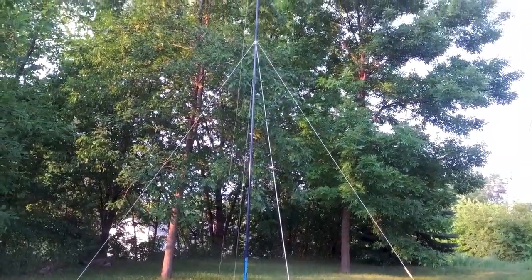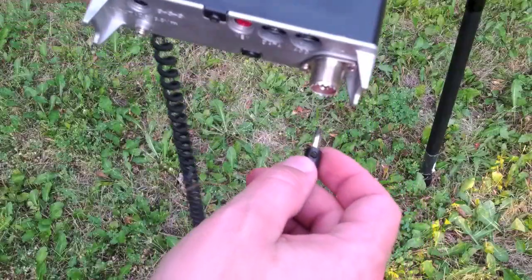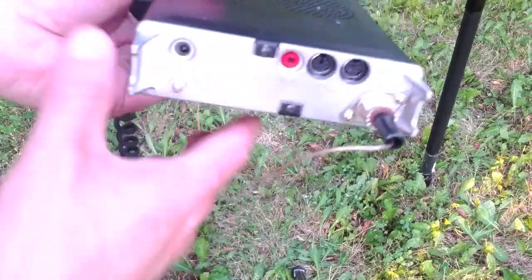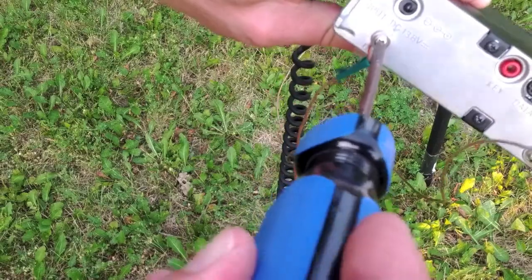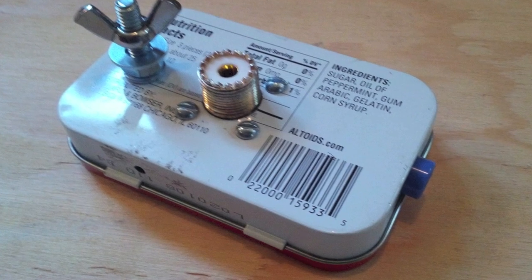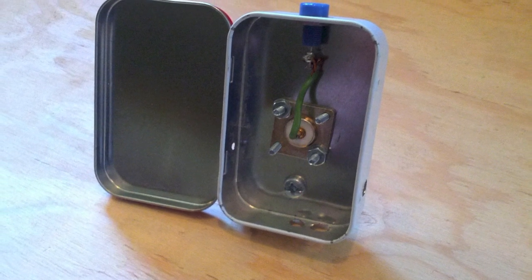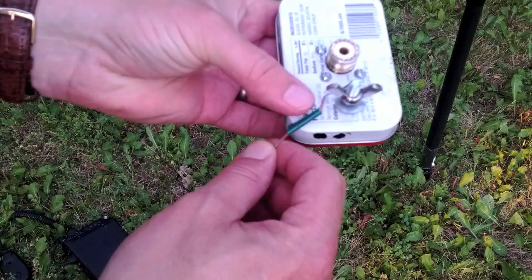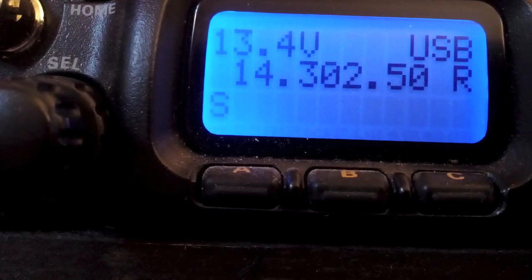Now that the antenna is up, we need a way to connect it to the radio. Here are three different ways. The simplest method is to stick the banana plug directly into the radio's antenna jack. Attach the other wire to the ground terminal of the radio and you're on the air. This will work fine as long as you stick to the band the wire was cut for — in this case, 20 meters. Another method is to connect a piece of coax between the wire and the radio using a simple adapter. I built this one from an SO239 connector, a banana jack, and a bolt with some nuts. This allows you to set up your radio farther from the pole. You may need to shorten the wire a bit to fine tune it for 20 meters, using the rig's built-in SWR indicator.